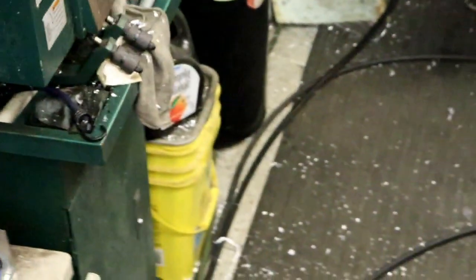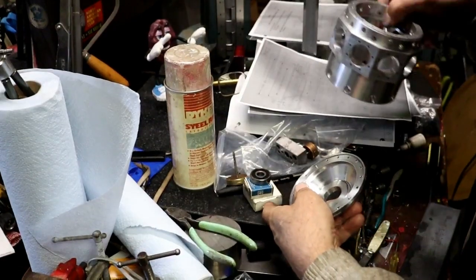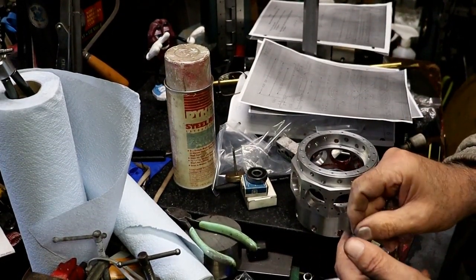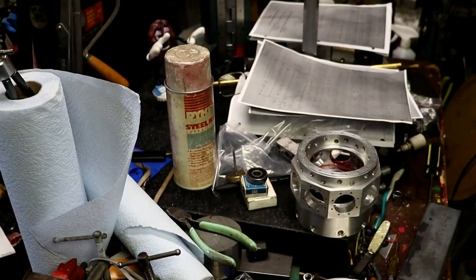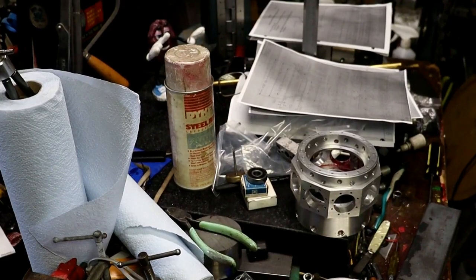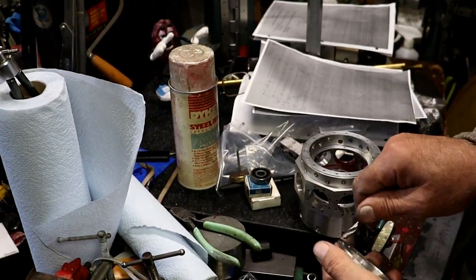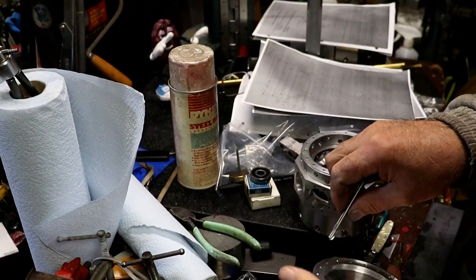Move you back to the surface plate here. Not much room on the surface plate. I need to deburr the back of these holes. I am going to take a spot drill, 1/4 inch. Let's see if that works. Working like a charm.